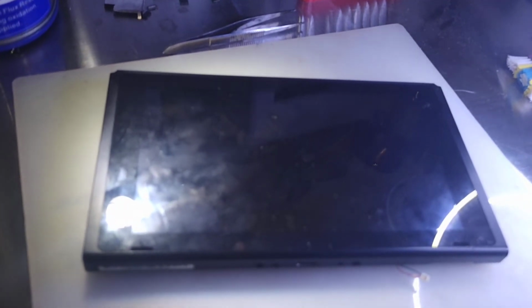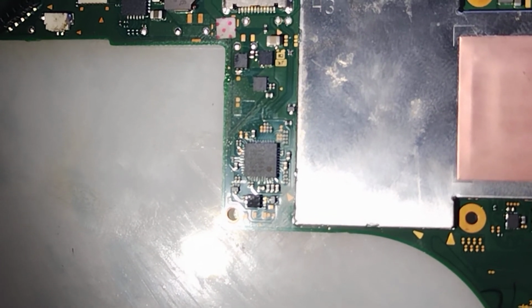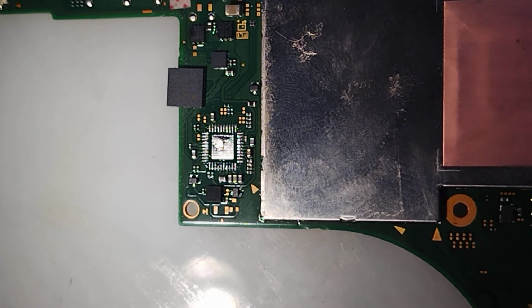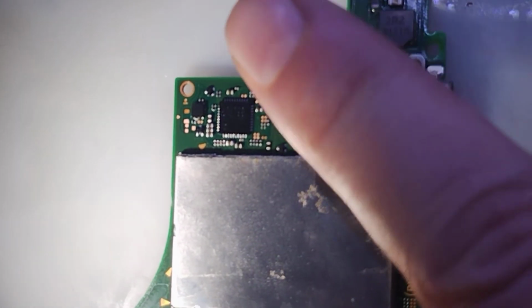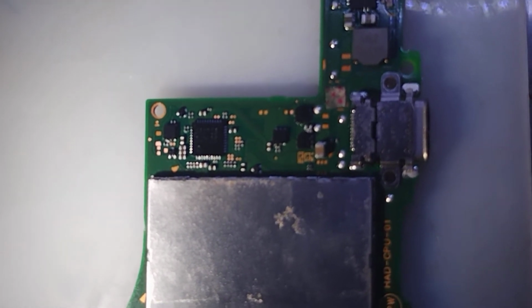And no, we need to do the M92 now. Fun times. Alright, and there's our M92 T36. Let's get it pulled. Alright, we got the bad chip off. Let's get all this old solder off, new solder on, prep the new chip, get it on. Hopefully we'll get this bad boy in action. Alright, we got the new M92 T36 chip on. Let's go ahead and get her bolted up and test it. Hopefully this fixes it. I'm pretty confident because we tried everything else.